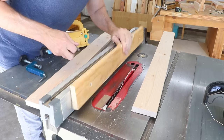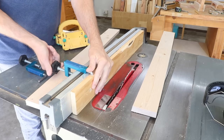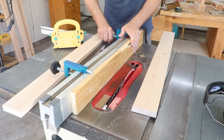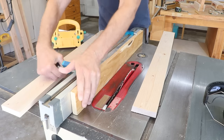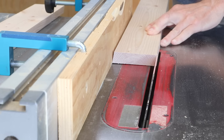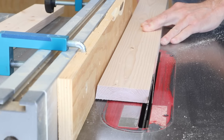After cutting the bevel on one edge of the board, I needed to attach this board to my rip fence to prevent that little pointy edge from sliding under the rip fence. I guess you'd call that kind of a zero clearance rip fence, because my regular rip fence has a gap there.